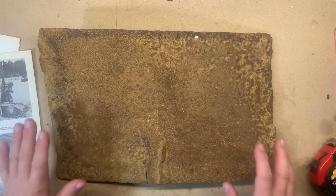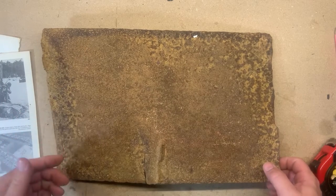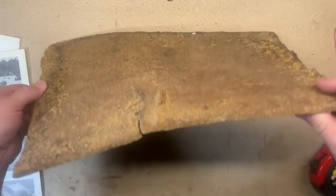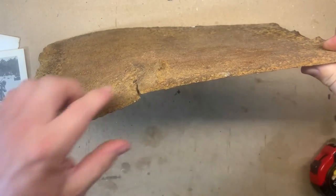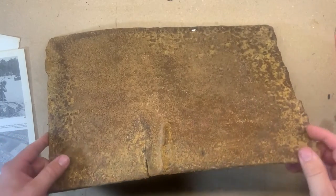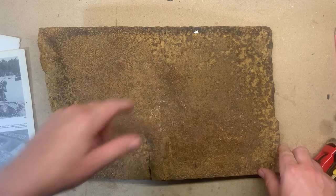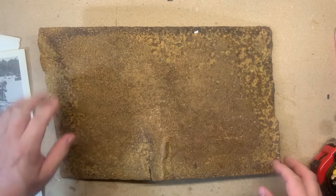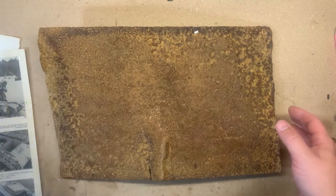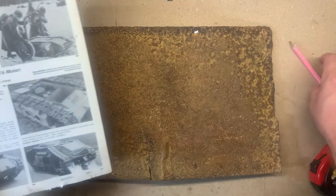So what are we going to do with this? As it stands, it's a good example of a piece of German armor plate from World War II - it's certainly got a bit of weight to it. We have our weld marks, we have a bend, we have a split. Can we bend that back flat? We're still going to end up with the dimples, we risk the crack spreading, we risk some further damage to the plate.